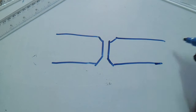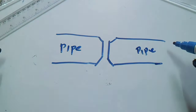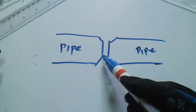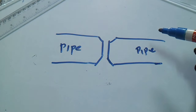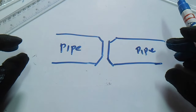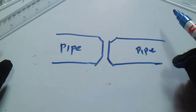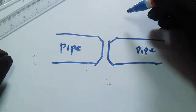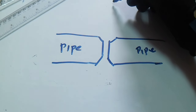So this is five and five — we have a gap and a double V bevel. Anyway, our topic is alignment. During fit-up, make sure your alignment is very good and quality also. To align the pipe, make sure you have tools like a spirit level, a square, and a measuring tape.